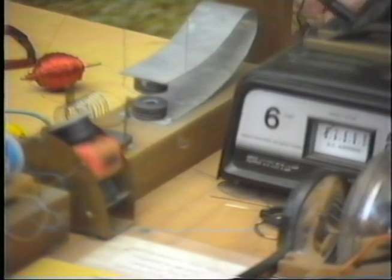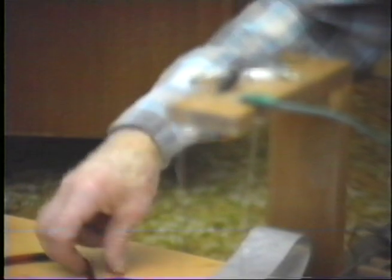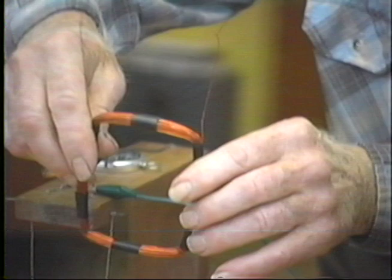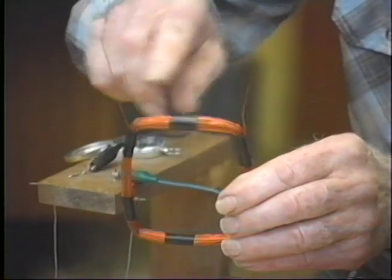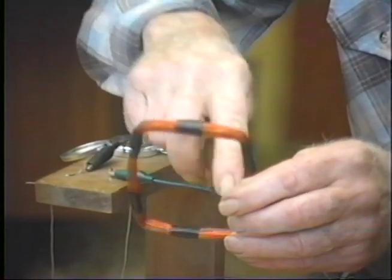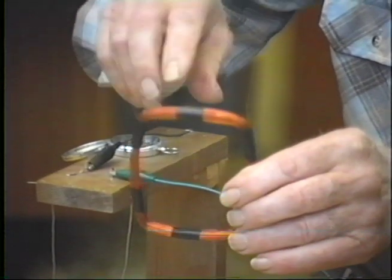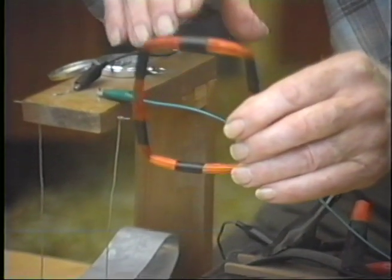Here we have a single wire, and there's not a very strong thrust between those magnets. If you want to increase that thrust, you wind up a bundle of wires like this, and that's much, much stronger — this is an electromagnet. These are enameled wires, so the current has to go all the way around this coil. Around each one of those wires there's a little magnetic field, but they all link together and make a stronger magnet, much stronger than a single wire.